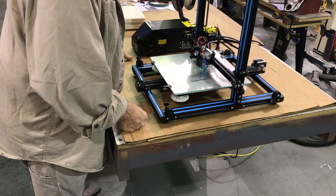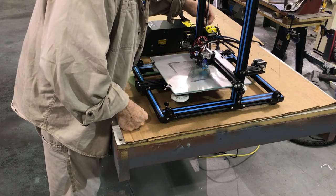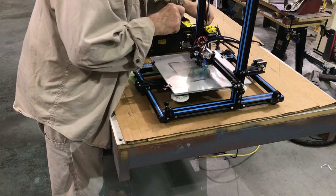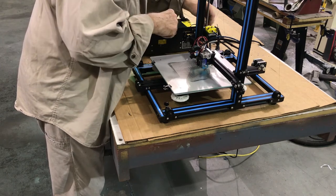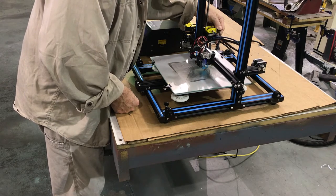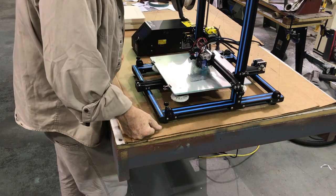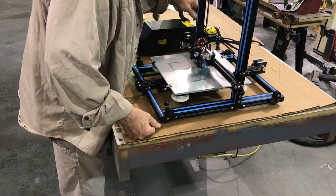There's an aluminum Mark 8 on the market — there are some cheap Chinese knockoffs, some good ones and bad ones. My friends over at McEwen sell a really good upgraded one where there's an inlet side that allows you to put PTFE Teflon feed tube in here, and you can trim it so that if you're doing flexible filament, when the extruder retracts it won't gobble up and make a big knot. That's a real typical thing with non-guided extruders. Also, for the Bowden feed tube — that PTFE tubing is a dime a dozen; you don't know where it came from. I use a Capricorn product.